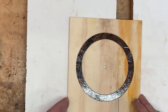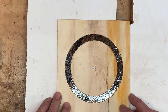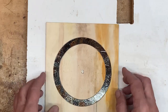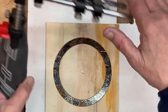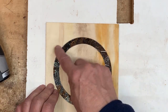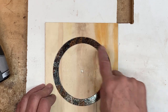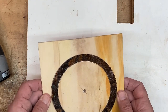It begins with solving a problem. I've encountered a bit of a problem here with my copper rosette. It turns out it's not as round as I need it to be, and I think what's happened is when I was cutting it out I used a Dremel, this kind of arrangement, and I think there was probably enough flex in the mounting of the Dremel, this is only plastic after all, for the cutter to have wandered slightly around the circumference of the circles. It's not much, it's certainly less than a millimeter,